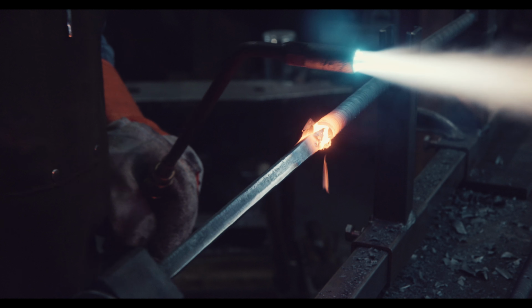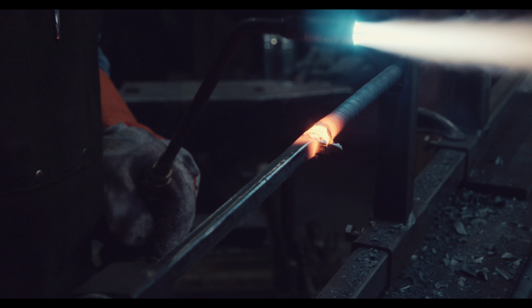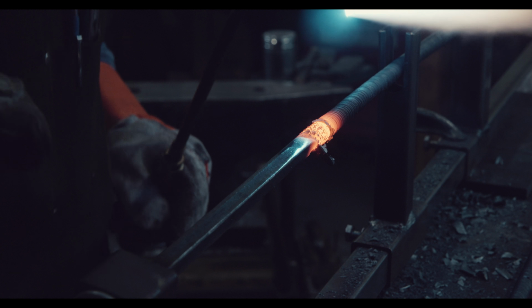During twisting, I make sure to count all the quarter rotations so that I always end up with a complete revolution. This is not important when completely twisting a bar, but it is a good habit for any situation where there are interrupted twists.